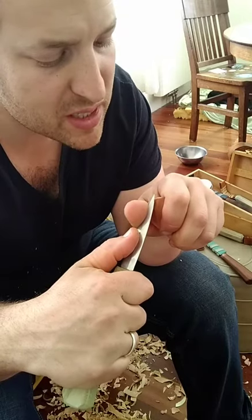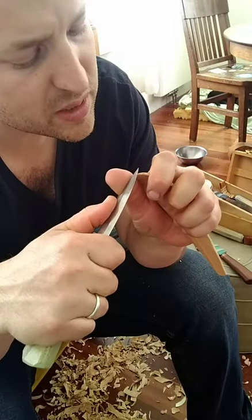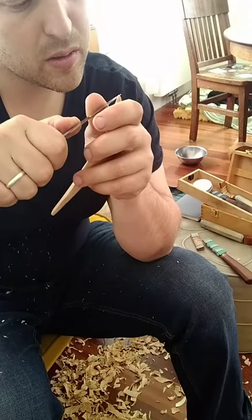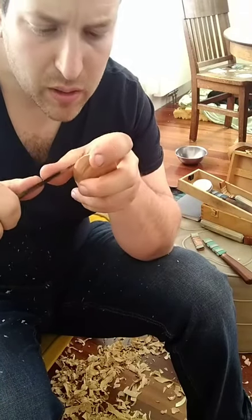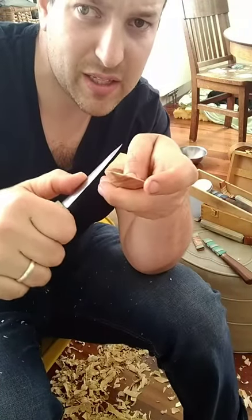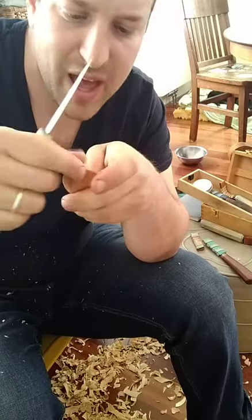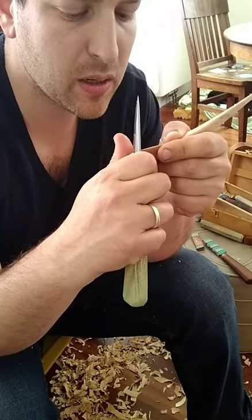And I do this not by trying to recut the entire thing, but just bring it down just the tiniest little bits. And then I do a very subtle bevel down, particularly of the front. So I'm angled, and I'll actually make my angle a little more shallow as I reach the front. So I started out like this, and then I'm getting more like this as I reach the front of the tip because I want to sort of blend it into that bevel at the rim. And I can see a little spot that's sticking up just a shade higher.